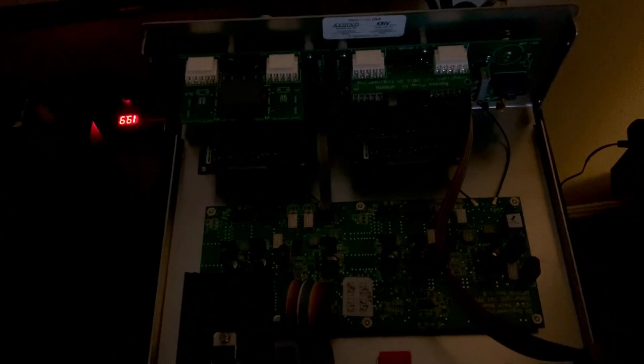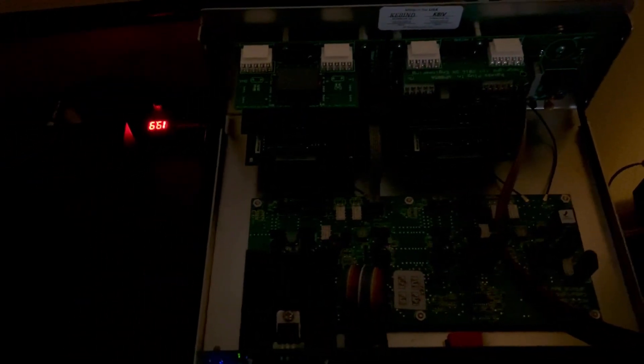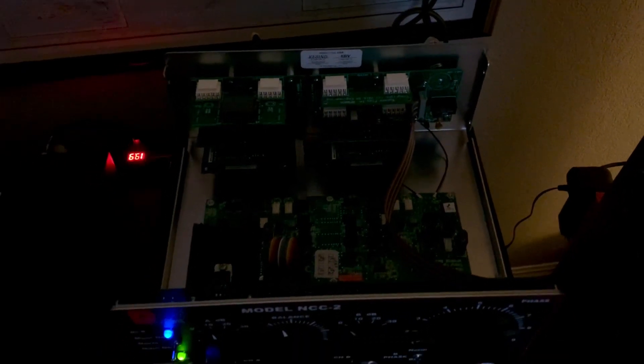It's kind of dark back here, I apologize, but I didn't get all the boards for this thing on both sides, both channels. I got the 75 to 50 ohm adapter. Then below that, I got that receiver guard, which is that protection board with all the diodes and everything. And I've got one right across on the other side on channel A. On the bottom, I got the 160 meter high-pass filters to make sure nothing gets through or gets really attenuated — anything down below where it starts rolling off around 1.8 megacycles. It cuts off about 1.65, 1.7, I believe.